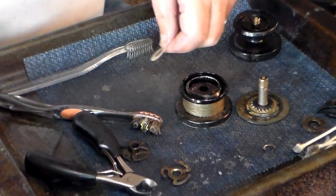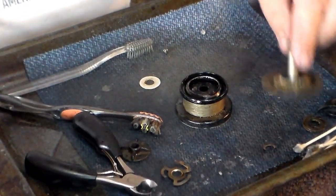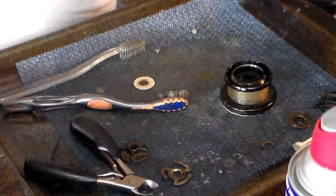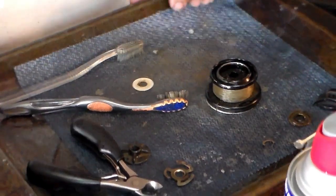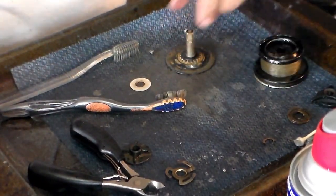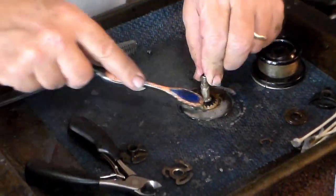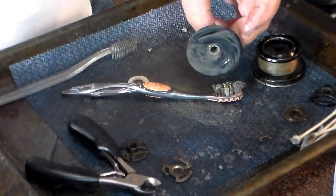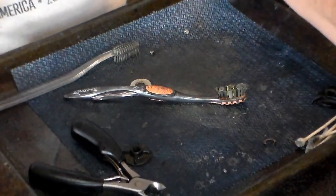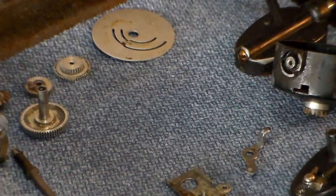Here's a spool we took from a parts reel. You've got the cap, the pressure plate, and see under here - there is a drag washer. This one didn't have one, so we're going to steal one out of this parts reel and put a drag washer in there. Normally I would have replaced this spool with another one, but this reel has a bit of sentimental value, so I've decided we're keeping it as original as we can and using as many of the original parts as we can. With all the parts reasonably clean now, we're going to move on to reassembling.